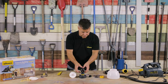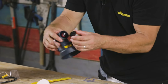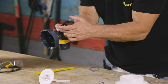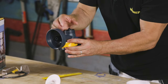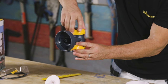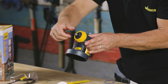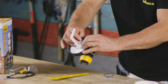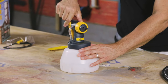Then you can start to reassemble the unit. Take the nozzle and you'll find there are four small notches on the inside edge. Line them up with the small nib that sticks up in the centre — there is only one of them along the bottom. Line that up, press it down and it'll be sealed around there just by pressing it. Then put it back together using the yellow union nut to hand tighten — not too tight, just so you can easily move the air cap. Then place the suction tube back in, pressing it down so it's nicely sealed, and screw it back down ready for use next time.